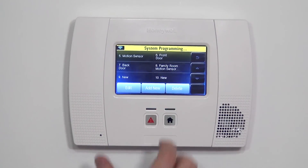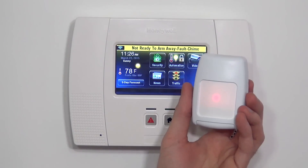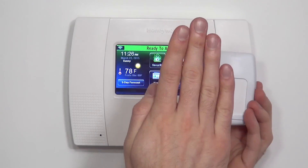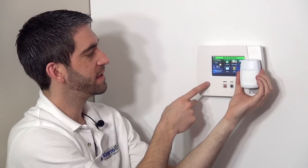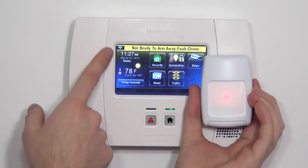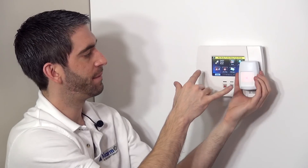The supervision will make sure the device is active when you need it to be. We save to lock in our settings. Now that we're on the home screen with our device enrolled, if we hold it up and move in front of it, as soon as the light comes on we get a fault. As soon as the light goes away, the panel goes back to ready to arm. The fault indicates the device is being activated. You'll notice it's not saying family room motion because there's no chime — it's just giving us the not ready indicator.